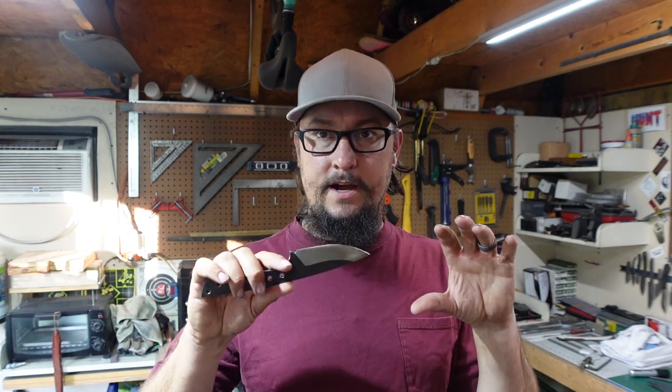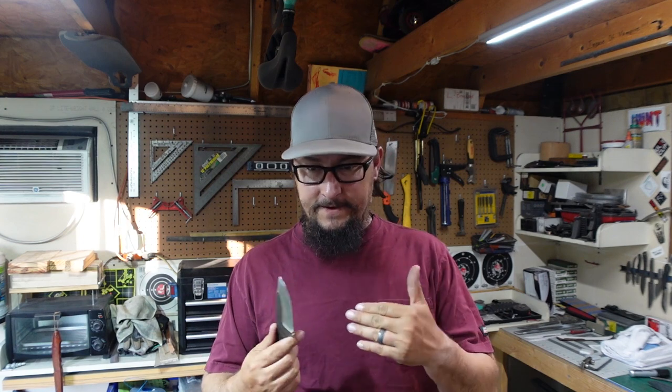I'm going to do a few rounds of normalizing because the piece that I cut this off of actually had some area that he had forged into a knife, so there was some heat put through this. I don't know how much shock or anything like that was put through this steel, so I'm going to normalize it. I'll bring it up to about 1600 degrees, let it cool down, bring it back up to about 1500 degrees, let it cool down, then up to about 1425 degrees, let it cool down. Then for the heat treat I'll bring it up to 1475 degrees and quench it in Parks 50.